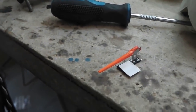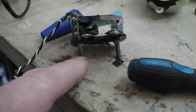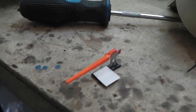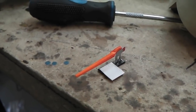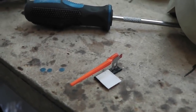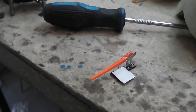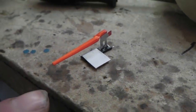With a voltage comparator, what it does is it measures the voltage across the battery and the voltage across the gauge, it compares them, and at a set point will trigger an output. I've used them in the past, but I found that when the voltage across the battery alters, the switching in point of the low fuel also alters. Now I have got an improved comparator circuit, which is supposed to be a bit more stable in that when the battery voltage drops it compensates. However, for now, as a plan B, we do this gauge.